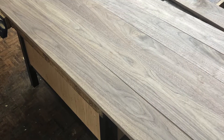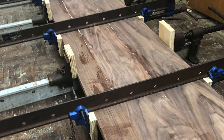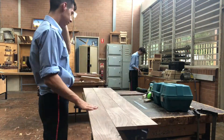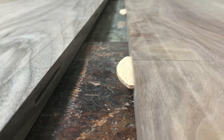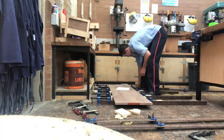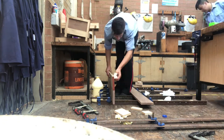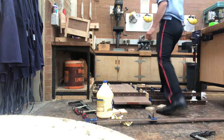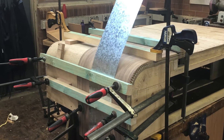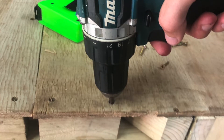In the meantime I started work on putting the tabletop and the back together, selecting the desired grain considering both aesthetics and timber movement. I had to glue the tabletop in two sections consisting of three pieces so that it would fit into the thicknesser, meaning that once it was fully put together I only had one edge to worry about. After doing a practice glue up for the encasement I started perfecting the jig, ensuring it was strong enough and square.